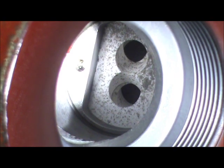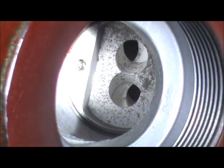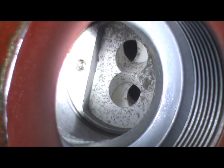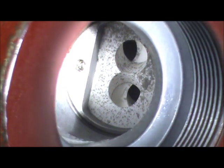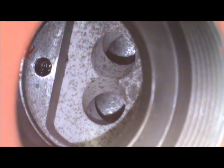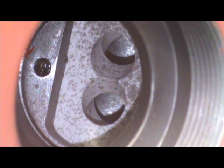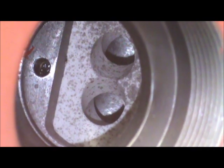I'm going to stop it at 12 milliamps and see if we've improved that mid-position setting. We're at 12 now and it looks very good. It's set up perfect on the open position and we did not come off the cam, so we know that the control board and the input signal is actually controlling where the position of the valve is. I'm going to run it to the 4 milliamp and check that again.